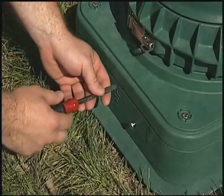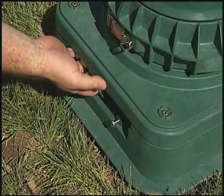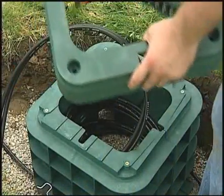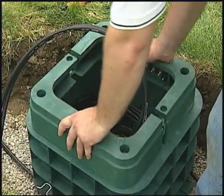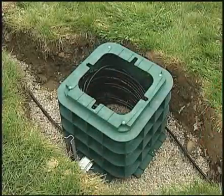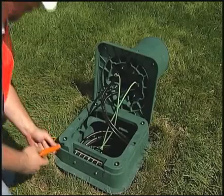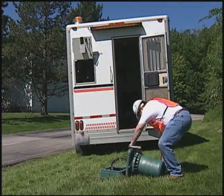A grounding spacer system for shielded cable installations provides access to isolated grounds without entering the splice closure. A stackable spacer system permits adjustment to changing grade levels. The closure base offers the ability to store extra cable, and you have the option to remove the Coyote GLC from its base and pull the sealed dome assembly out to a suitable work environment or into a splicing trailer for network modifications.